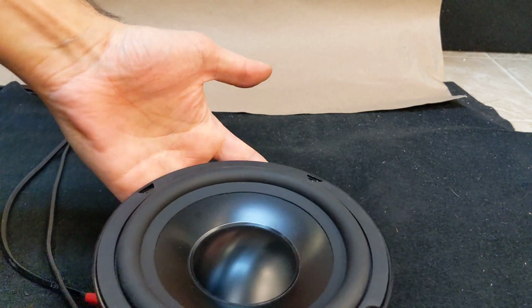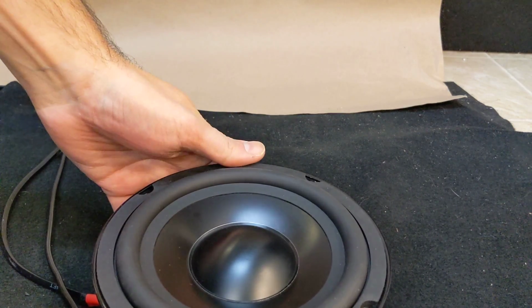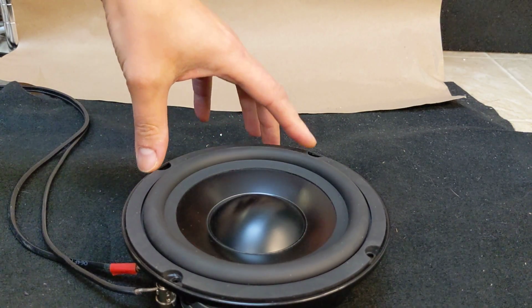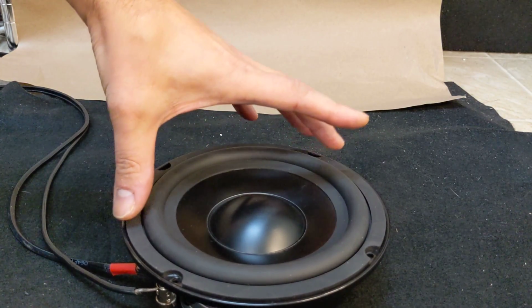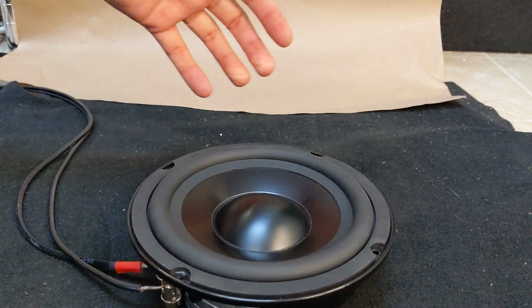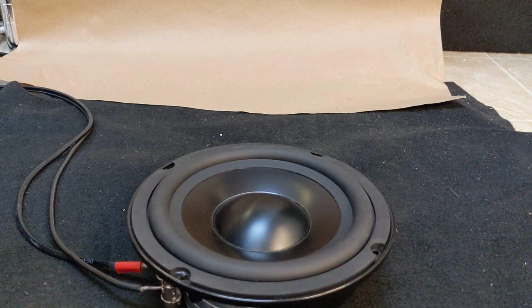We have on this one here, and we'll show you the unsmoothed frequency response. And then we have a Klippel frequency response from the first prototype, which this one's response is probably going to be a little bit different, a little bit smoother. But this one also has less neo inside the motor. So the QTS is up near 0.7, which is what you want for an infinite baffle situation, which all of these drivers are designed for.